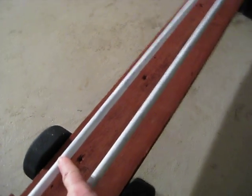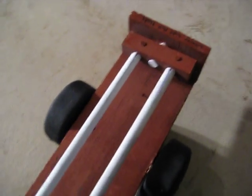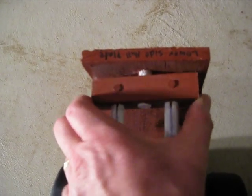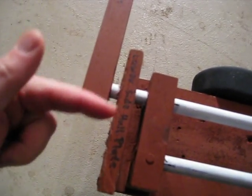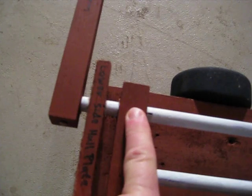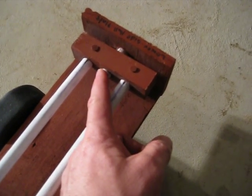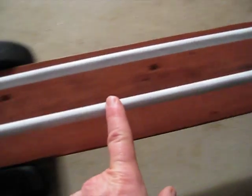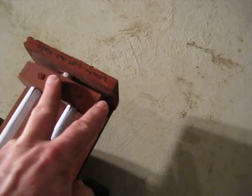These white bars represent the twin torsion bars. This is the block that they're anchored in. This is the opposite hull side wall. The torsion bar goes through the hull here, through this block. There's a bearing surface here. The energy goes through this torsion bar, through this block, pivots on this pin, bushing, bearing. Comes back on this torsion bar, which is also anchored. So it's anchored here, and they're both anchored here.